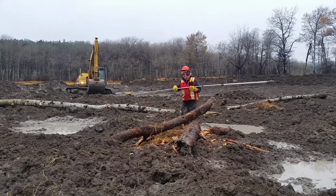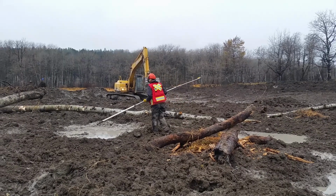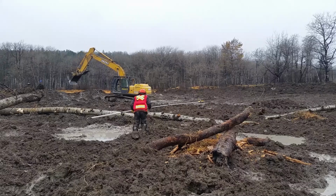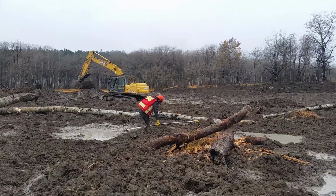The excavator in the background is doing the final shaping of the wetland. Topsoil that was spread by the dozer over the compacted clay is being rearranged into shallow pits and mounds, and the tracks left by the heavy equipment are being swept and loosened. The laser level is also being used to measure the final depth of water in the wetland.